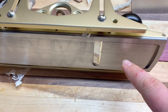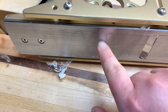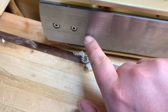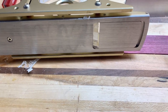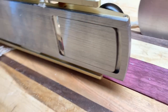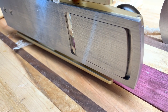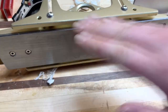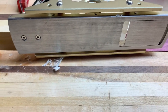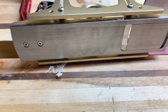But now look at this thing. There are scratches along this whole thing. It basically appears to have been ground out with something like 100 to 150 grit belt sander. And the worst part is those grinding patterns have a deviation to them — they're not actually directly parallel with the plane. So you get a cross pattern, which creates friction.